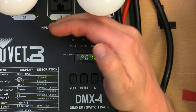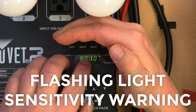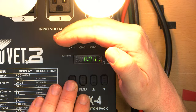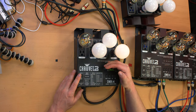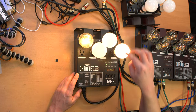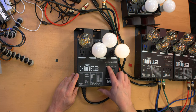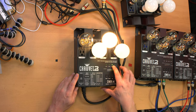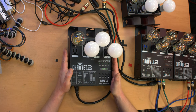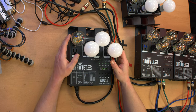Here is the faulty dimmer pack. Before it wasn't lighting up all the segments on the display, and now it is — a slight change in behavior. I'll change it to program mode. Previously two channels appeared bad, but right now this bulb is not lighting even though it should be chasing around in a pattern, and the LED for that channel isn't lighting up. The others are chasing across, but just channel two is not lighting up. I could have sworn channels three or four weren't lighting up before either — I wonder if it's a mechanical fault.